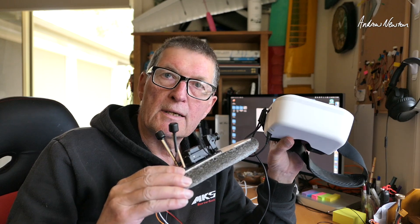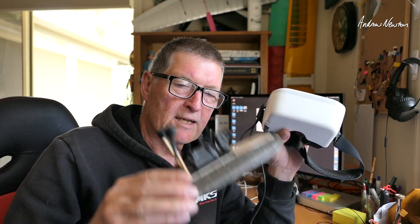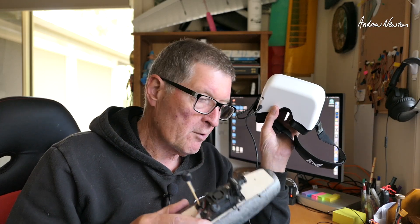Now what you need to do is read the manual. Thanks for watching, see you in the next video. No, I'm joking. Let's go through the procedure to link them together and upgrade the firmware. The biggest problem usually is that the firmware on the video transmitter is not as new as the firmware on the goggles. The goggles are quite recent; the video transmitters have been around for a while.